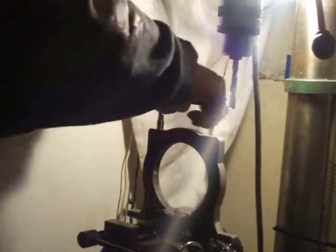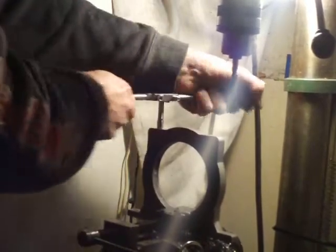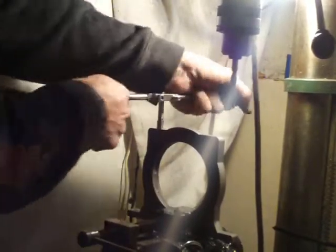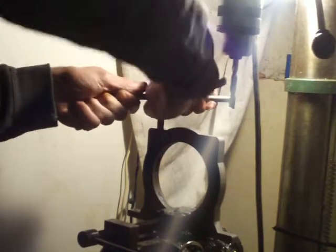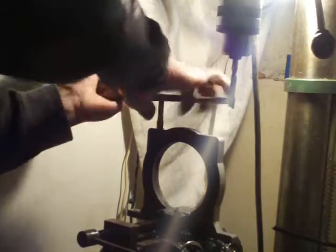We want to make sure that the Tesla turbine is a total loss system where no considerable pressure builds up inside the actual turbine itself. With the closed side version of this turbine that I'm selling, there is actually a vacuum that occurs on the opposite side — the pulley side of the motor or turbine. The chances of threads popping or hoses breaking is very unlikely as long as there is no blockage in the exhaust of the turbine itself. That is the only way that pressure could build up.